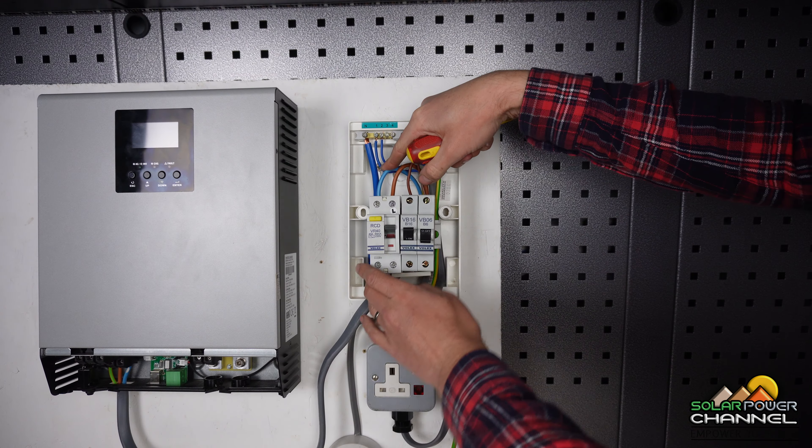I've taken the cables out of the consumer unit — this is the incoming cable. I've given myself plenty of room to work, so always make sure your tails are nice and long. When you splice a cable like this it won't have any protection on the earth, so you buy these sleeves on rolls. I'm going to push the cables up through the back of these switches, then connect the brown live wire to the live terminal on the RCD.